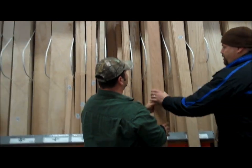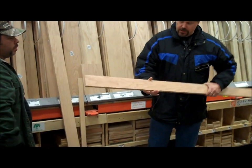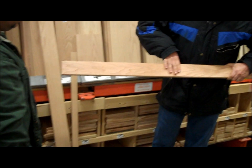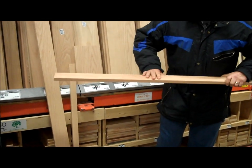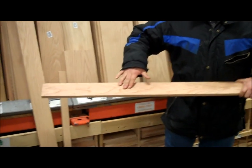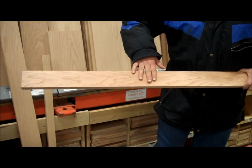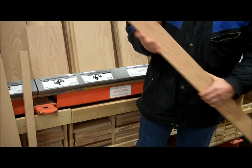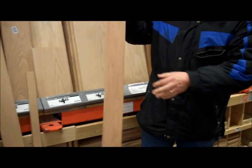I'm going to make a good point for this, though, is that this is a terrible piece of wood, but this is what the lumber stores generally want, because when the rings are facing you like this, it's really pretty. So they want this stuff. This is what they're going after. And for anyone who thinks they can take this down to a single growth ring, feel free. Good luck. I won't stop you. So if you want to do that, you go right ahead. But this is something, for now, self-bow-wise, to avoid.